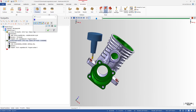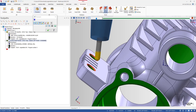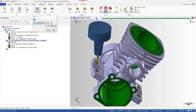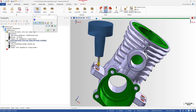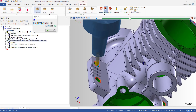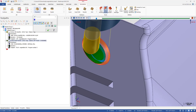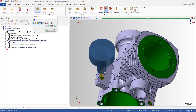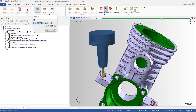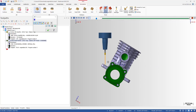You can see we are using a much shorter holder — no need for a long holder — and we use the ball mill to cut this chamfer. Very convenient, and we have no collision problem. This is a good way to make the chamfer when the holes are too close to the wall. With the Flow Line toolpath it looks very nice, and for the second hole it keeps making the chamfer just as well.